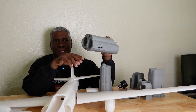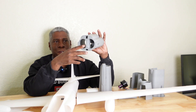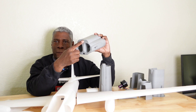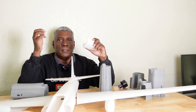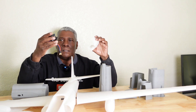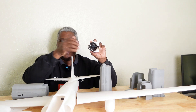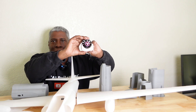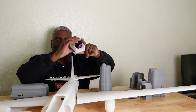I also like that he's got a slot on the bottom of these here that goes through the bottom of the fuselage. So the wires come through here and up through the front. He's got a slot on the top as well. The EDF hatch on the bottom - this fan section here - the front is here and the back is here. This will come in and sit in here like this, and the wires come out through the front. Very nice design for the wire routing, running right down to the bottom of the fan.